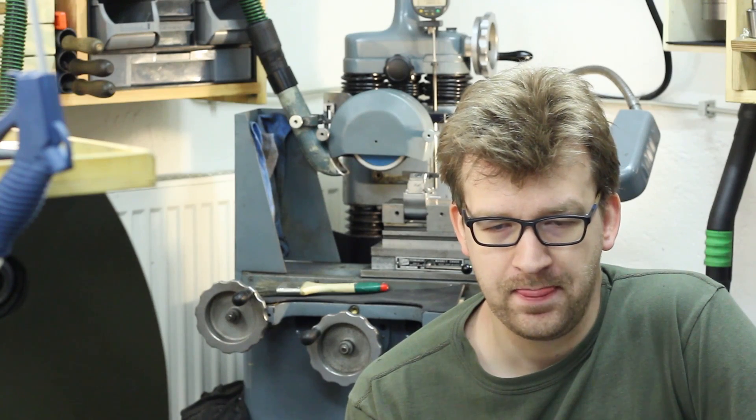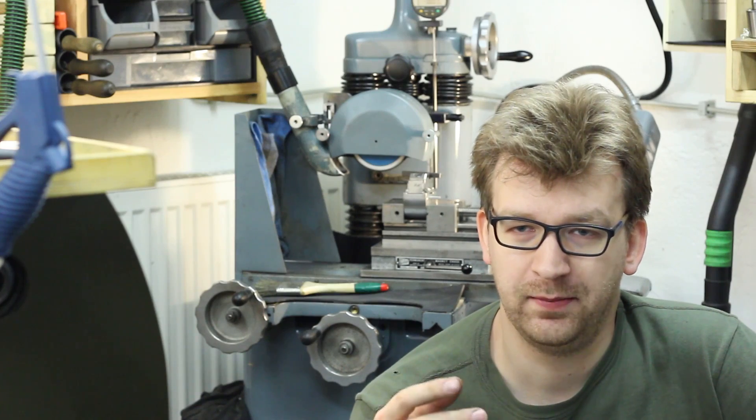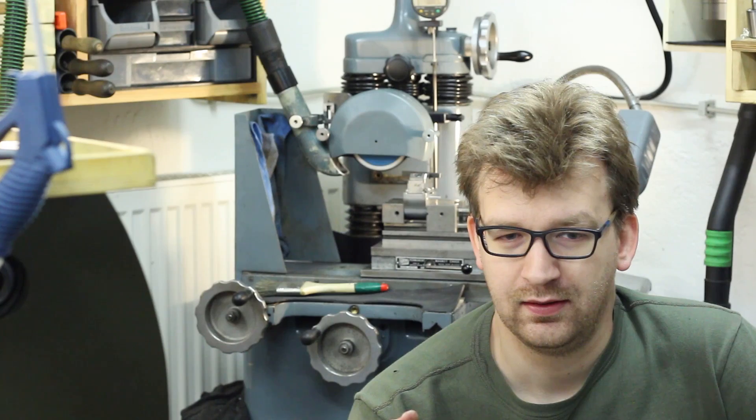I showed this previously in the video where I showed the making of some specialized wire threading tools, and I got quite some feedback about it. For me, regrinding carbide inserts is a very valuable process. It's rather stupid to do it in a heavy production environment because that would negate the advantage of a carbide insert all being the same. But for me, doing one-offs, prototyping, and small quantities, regrinding a carbide insert to a geometry that helps me is a very cheap and fast way to adapt to a job. Also, regrinding an insert to a very positive and soft cutting geometry helps me with my rather light-duty machines.